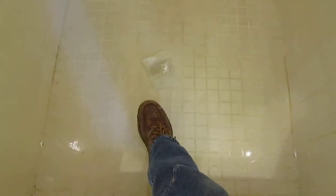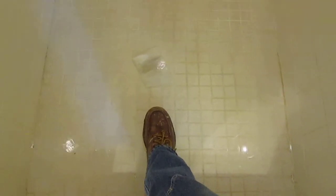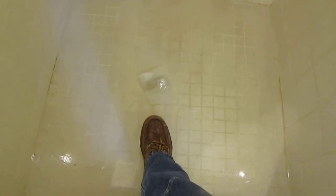I just put a piece of toilet paper over the drain and I let it sit there. They make a tool for that, but I don't usually use it anymore. I like to use the toilet paper, and then I just stand here and let it fill up with 1.5 inches, because I forgot my little tool. It's like a little dam. They call it a donut, and you put it around there. And I have left that on jobs, so I started using toilet paper instead.